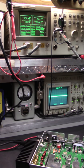I'm going to show you a couple things. I'm not going to go in depth. I show these same radios over and over, and I could repeat the exact same thing. All right. This is the truck driver tune, like Jason's radio, a bunch of other ones. Not truck stop tune, truck driver tune. The type of tune that needs the maximum range, clarity, and receive less white noise. Period.